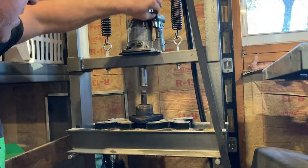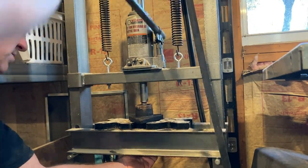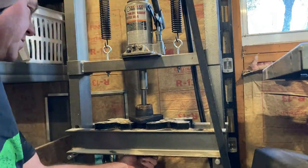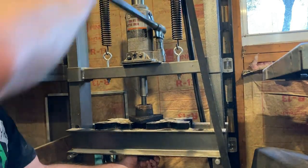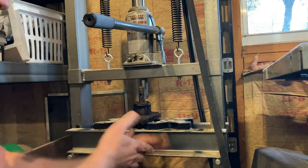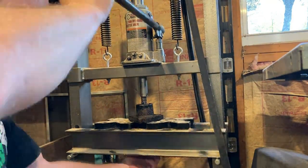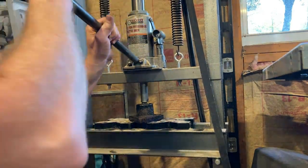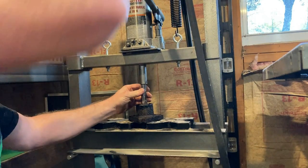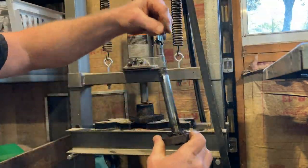You can see here I'm trying to press the shaft out of the mandrel. This particular design of the mandrel does not have a retainer clip or ring on the bottom like most of the others do, so I ended up pushing the whole bearing out on the shaft. I'm using a socket to press the rest of this through. Obviously there are probably better tools for this, but I just use what I have. These are the items I have, so they're the ones I'm using.